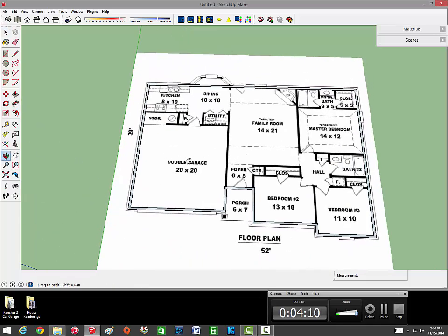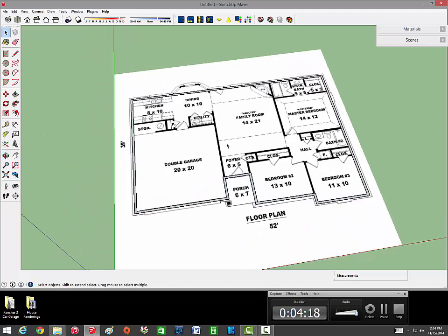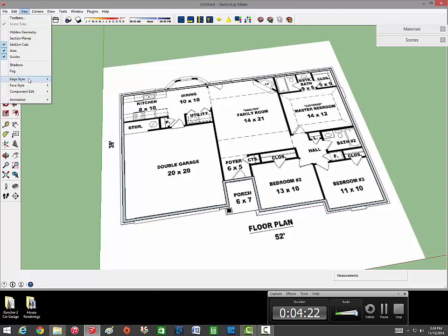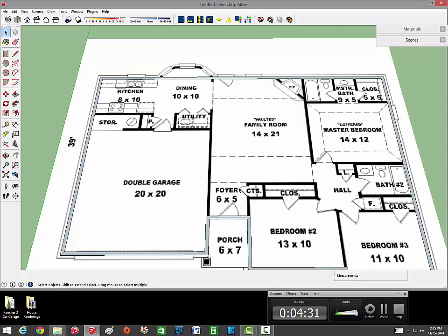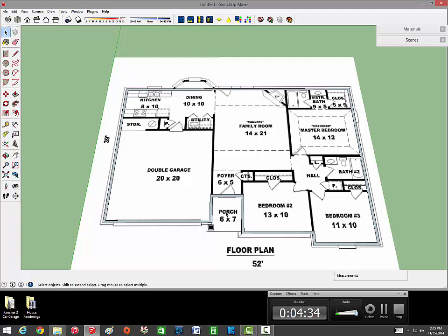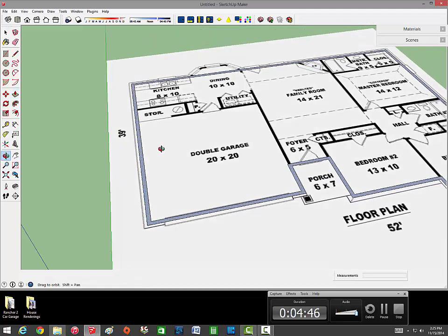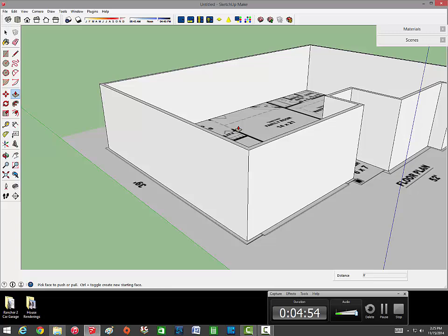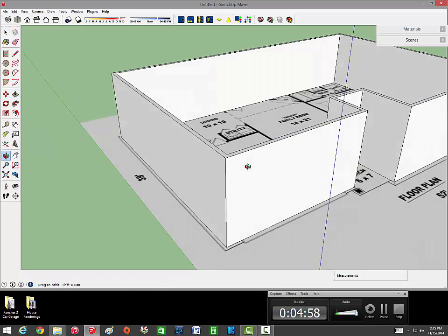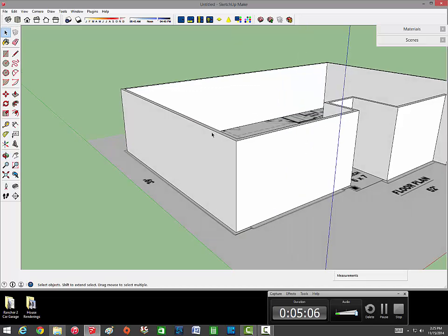I'm not going to use up any time doing the interior walls. If you guys want to see that just leave a comment and I'll do it in another video. Basically I would do the same process I used on the outside walls, but with interior walls it's a little bit trickier because you've got door openings. For the front I'll do the front door, garage door, windows and all that. For the height of the walls I go eight feet, and then if you guys watched my first video I go an extra four inches because I take the roof and I push and pull the outsides down so it's got some trim around it, which I'll show you guys in this video.